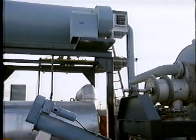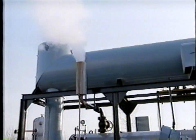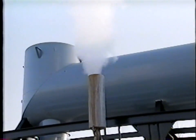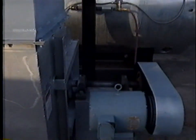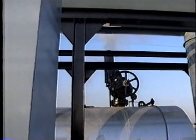And this is the heart of the system. The process enables us to capture harmful gases and airborne toxins, which we send to another chamber for elimination. This chamber, called the thermal oxidizer, combines oxygen with gases and initiates combustion. Combustion temperatures are maintained at a level determined by the EPA and government standards, and they completely destroy any toxic compounds introduced. Temperatures will vary from 1,350°F for mildly hazardous materials to 2,450°F for more difficult compositions.